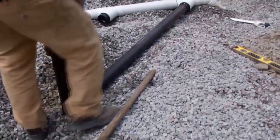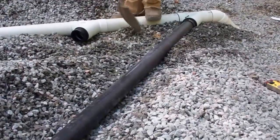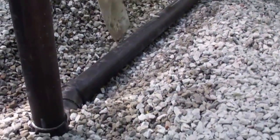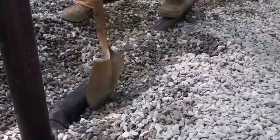So take your time — once you pour concrete on top of this, you will not be moving any drains. This is also the time that you're going to want to run any electrical lines, central vac, along with your main power and water lines — anything you want to have set into the floor — and you direct the stuff straight to your mechanical room.